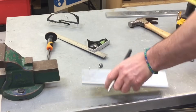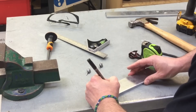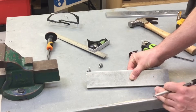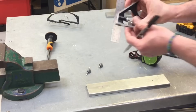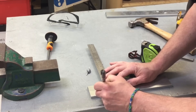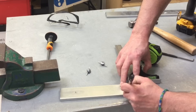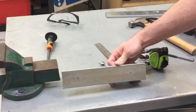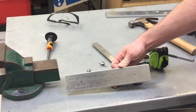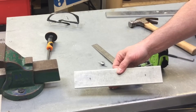I've come in approximately 50mm from each end. Now I've got to find the center — this is the more crucial mark. I set my combination square up, position it on the side, and find exactly the center. I do the same on the other end, so I've got a little cross. We can now use a dot punch before we drill what will effectively be three holes — progressively larger — in order to insert the turnbuckle clip.